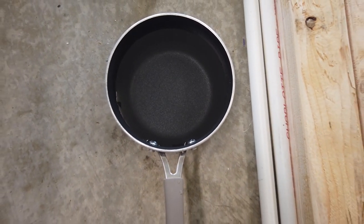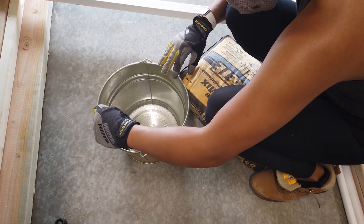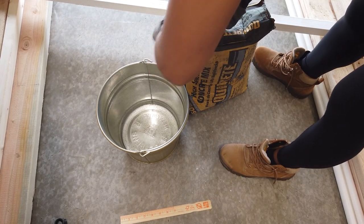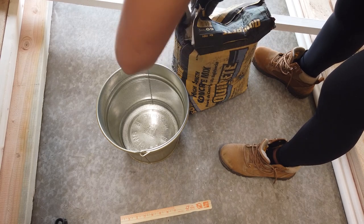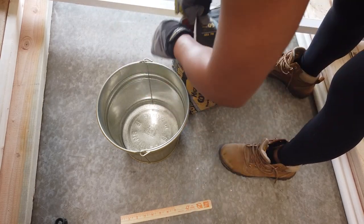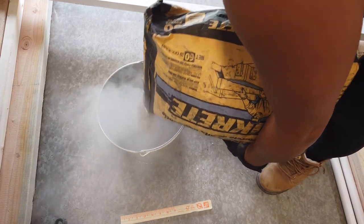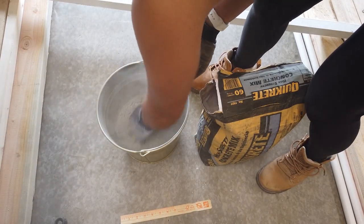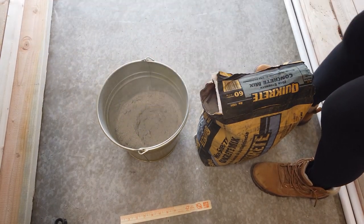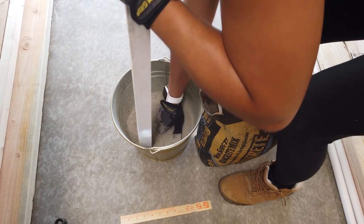You're also going to need water. So what I'm doing first is I'm going to add the concrete into the bucket. If you read the directions, it tells you to add six inches to the bottom of your bucket or whatever you're using to set a post. But since my bucket was super small, I just added however much concrete I was going to use, and then I added the post directly into it and then added water and mixed around it.